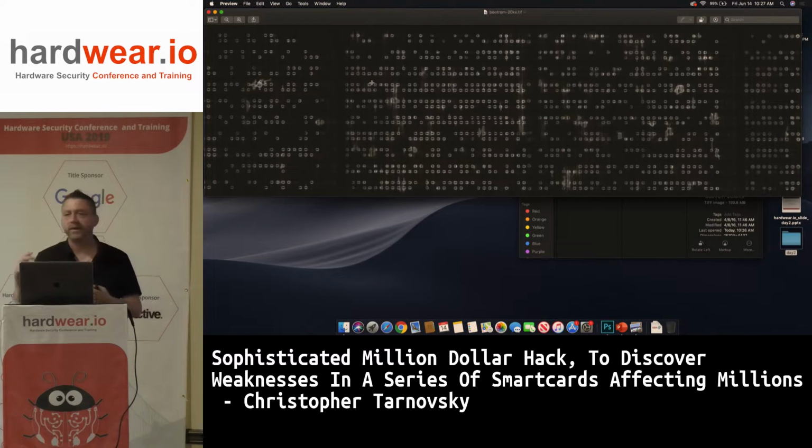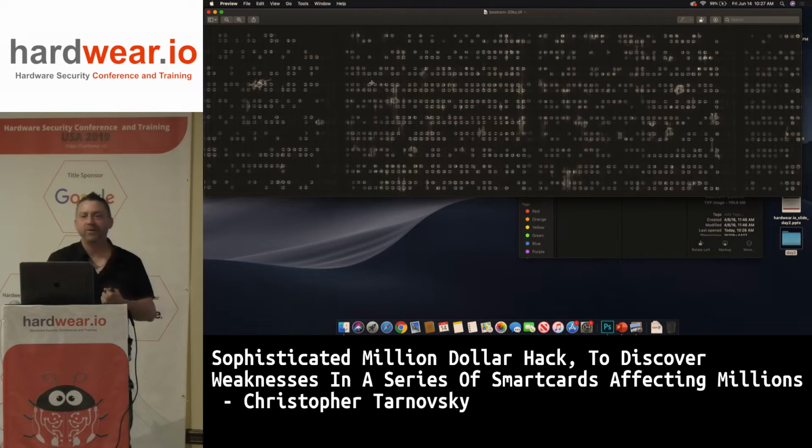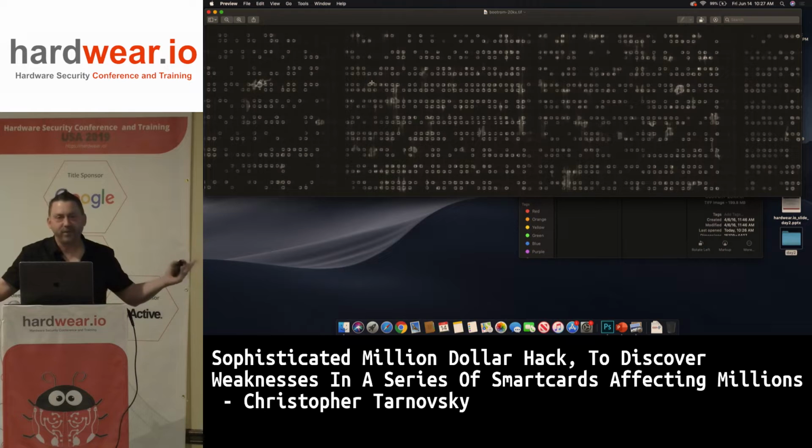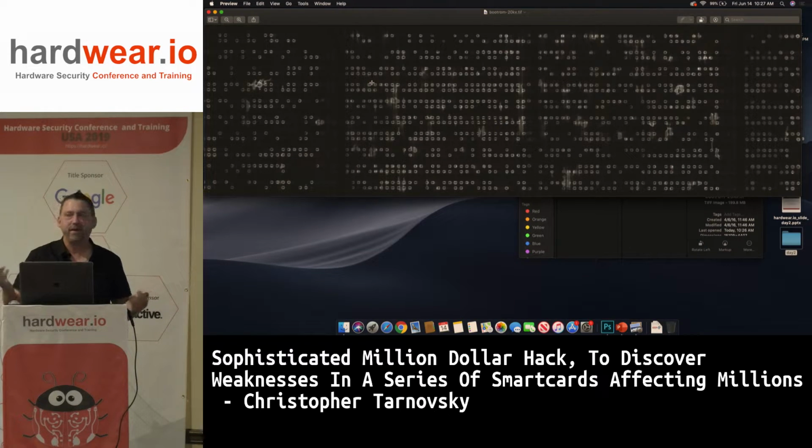If it hadn't been for Chris, I would have had to basically cut the output of this ROM. On an 8051 and on ST, sorry guys, if I cut the data bus lines, all of them, the bus floats to FF. And FF doesn't do anything. FF is like store X on an ST chip. On a 6805, it's going to be like store into X some value. And on an 8051, it's like a move into R7, something like that.